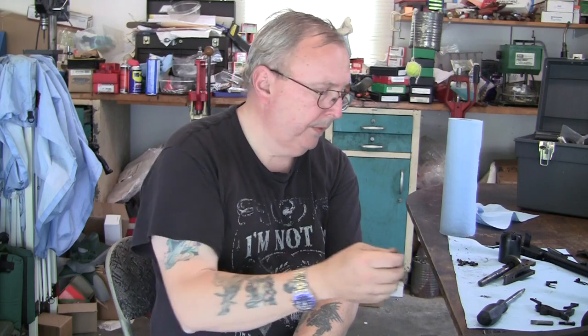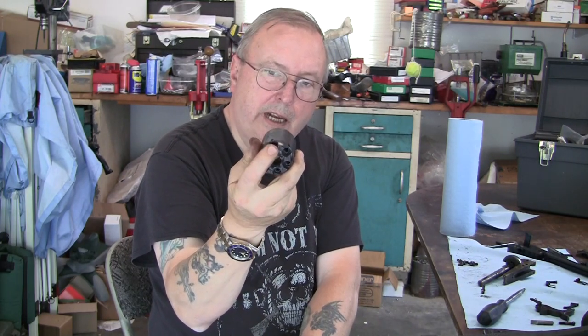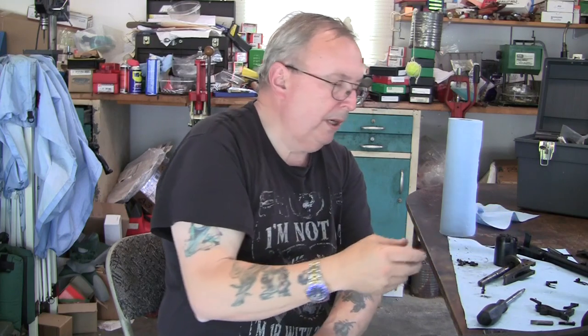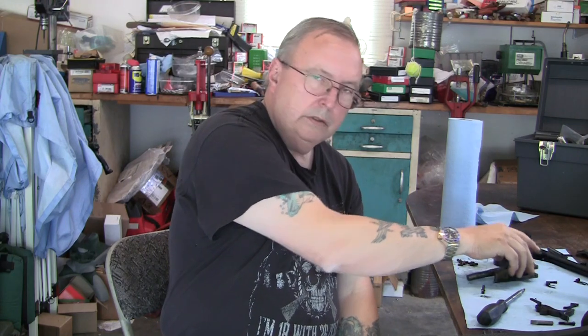That did work. You could see where some of them would go into the little notch and there would be a deformation in there, but basically all of them stayed on the other side of the frame inside the notch where the nipples were — that's where most of the cap fragments stayed. What was happening with the factory nipples is the cap fragments were either sticking on the hammer or blowing back in a way that when you pulled the hammer back, they would fall down inside the frame and into the action itself. This did take care of that problem. I did not have those horrible jams where I had to reach in and constantly scrape cap fragments out of the inside of the frame. So that did stop — it does work as advertised.